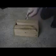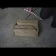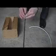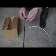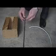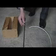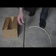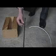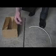This will break before it comes out, and you're guaranteed to get that cable through the wall in 2 to 3 seconds, if not quicker. There are bigger bobs to take larger sizes of cables, as big as you want, and just bearing in mind each bob, which this one will take I think about 8 or 9 different size cables, data cables, aerial cables, mains voltage cables, and the big ones will take large ones, but you'd only need the next size up to take quite a few.